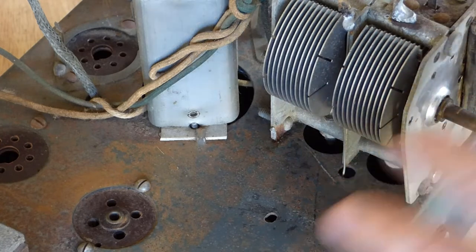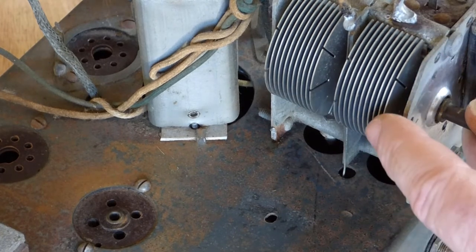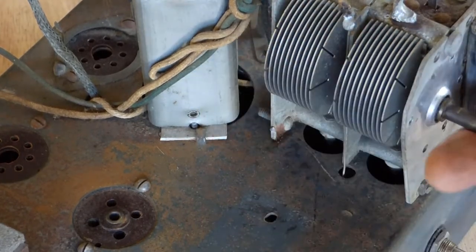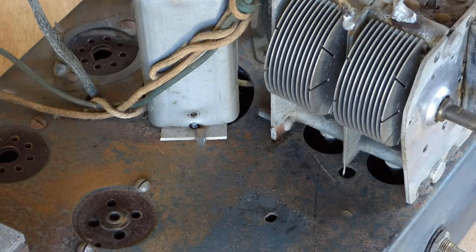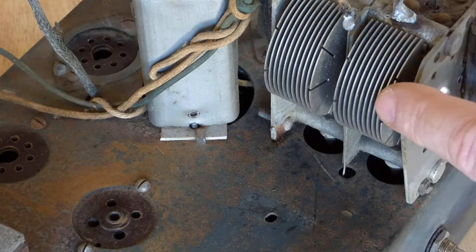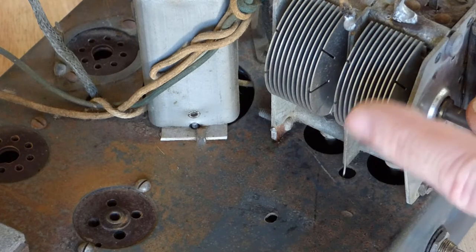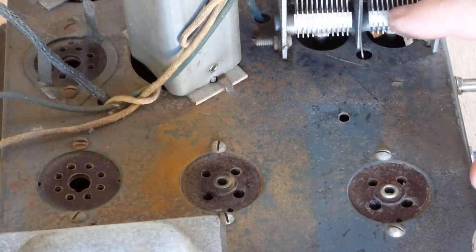You can see the split rotor plates on the outsides — those were to help fine-tune certain parts of the band by increasing or decreasing the capacitance in certain areas of rotation. You will see these tweaked — do not try and straighten them back up because quite often they're bent for a reason. None of them are bent on this, which tells me they threw it in and went 'near enough is good enough.' But certainly on sets from major manufacturers — the likes of RadioCorp, BNZ, Radio Limited, ACRAD, Collier and Beal — those big manufacturers would have had rigorous testing procedures. Every radio went on a test bench and was run up, aligned and checked before it went out the door. So if there are alignment issues you will find plates tweaked out slightly to fix those. That's my understanding — please correct me if I'm wrong.